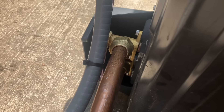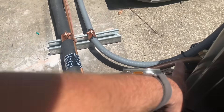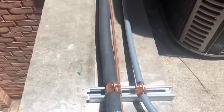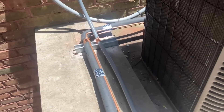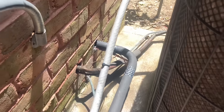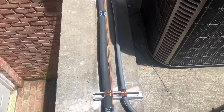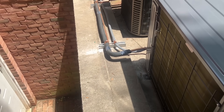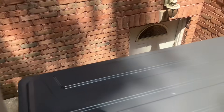Again, that flare connection — three-eighths and three-quarter, regardless of the size. I put a nice little kick here, bent down a little 90, across. I got the inch-and-a-half unistrut — looks beautiful, really looks beautiful. I even used some of the line set tape to secure my communication wire — just two wires needed here. Serial communication, non-polarity.